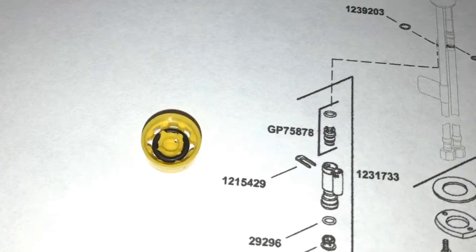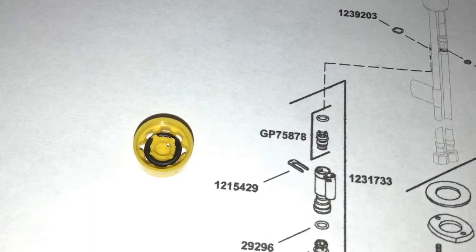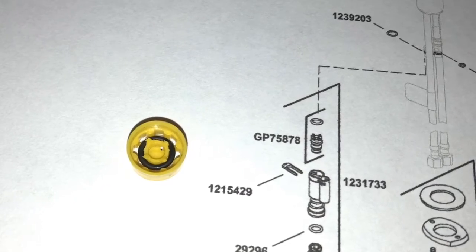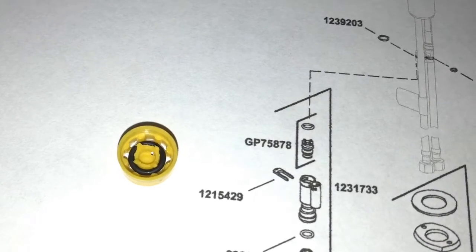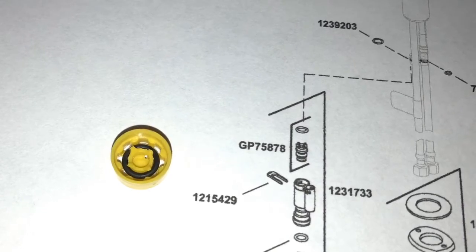If you get this out, you'll go from about 1.3 up to about 2.2 gallons per minute. I know that doesn't sound like a lot, but it's about a 70% increase and it makes filling the sink to wash dishes or filling a pot with water much much faster. I hope you found this information useful and can get your faucet running equally well.